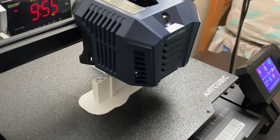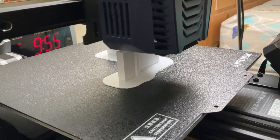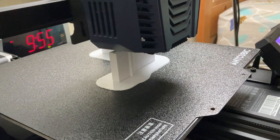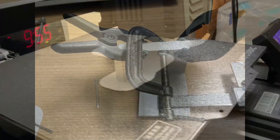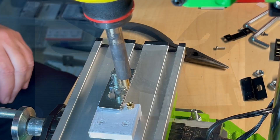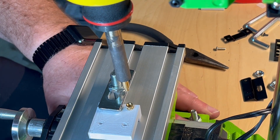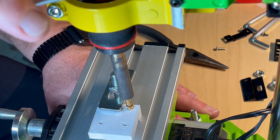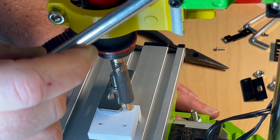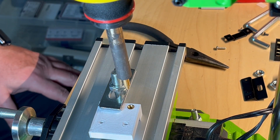I printed the pieces up and they went pretty well. I had to separate some pieces - like the first and second piece - and then glued them together later, which just made the printing easier. Where I was screwing the pieces together I put in brass inserts, which makes the screws firmer. With DROs you really don't want things moving around, so I used a press with a soldering iron to get them in and make sure they were 90 degrees to the piece.